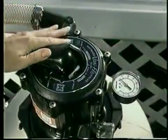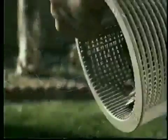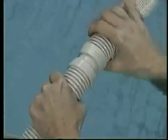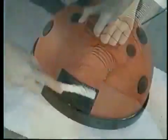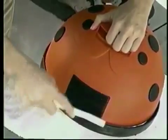If your Hayward above ground automatic pool cleaner isn't clogged, make sure your pool's filter is clean and that the hair and lint pot are cleaned out. Check all the hose connections for air leaks, including the hose that connects to the skimmer. The screen under the handle on the back of the cleaner should be cleaned as necessary to ensure proper flow to the steering of the system.